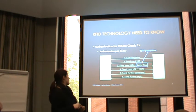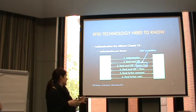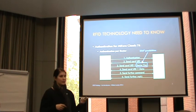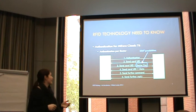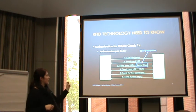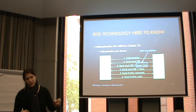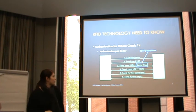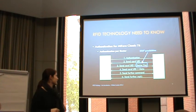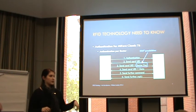For the authentication: as soon as your card gets into close proximity of the reader and it wants to authenticate, it sends the first request. The card responds with its UID - that's just the default protocol, it always does that. The reader then sends back the UID information and the sector key. I tried brute-forcing the sector key first and it would have taken about a hundred thousand years, so you don't want to do that. Once you have the sector key, the card sends back the information from that specific sector.